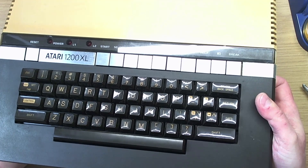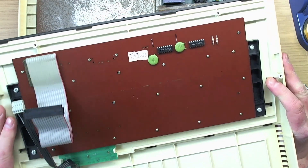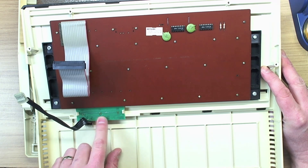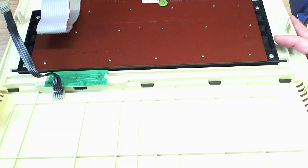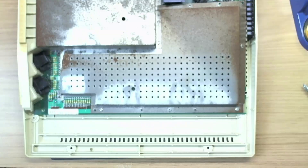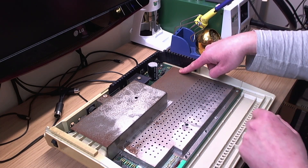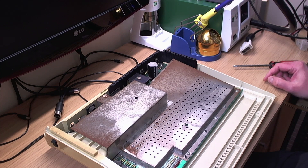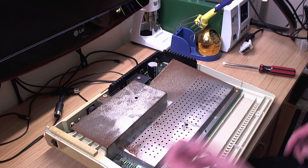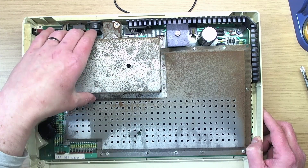Let's lift the lid off. The LED board and the console keys are plugged in, so why on earth that doesn't work I do not know. Maybe the LEDs are dead. There's a lot of corrosion around the back of the LED contacts. Underneath we've got — the shielding has sprung off the board in the corner and it's just pitched up into the air. We've got a missing screw on the corner — that's easily fixed. And look at the rust! Where has this been stored? We've got rust on the channel switch, rust on the power input, rust on the power switch.